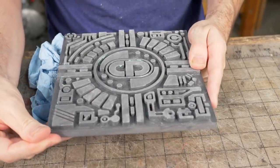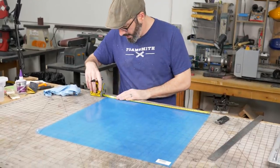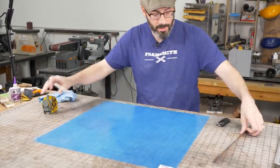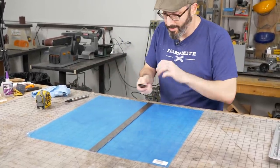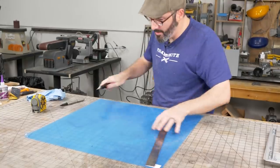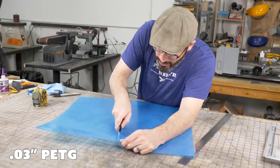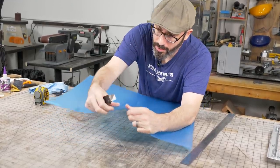I'm feeling pretty okay about this and I think we can give it a shot and try and pull some plastic over it. I bought a two-foot square piece of plastic because my frame can accommodate a one-foot square piece, so I can cut this into quarters and get four pulls out of it. That is the plan anyway. I'm going with PETG on this one — that's what I do most of my vacuum forming with because it's easy. It doesn't bubble or anything, and this is .03 inches thick.